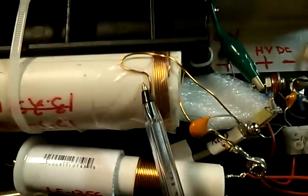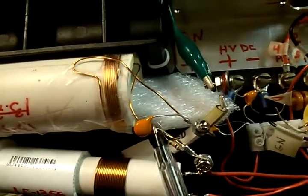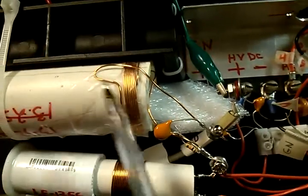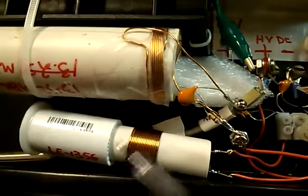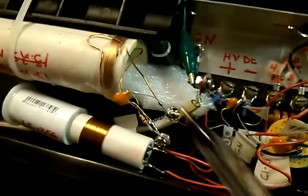This is the original one here. We've got 2 in here. This is the non-adjustable. It's going to be replaced. We've got a 12 picofarad capacitor here, and we tune it by just having the right amount of turns on here. This was a 1.5 inch PVC, 8 turns on here versus 17 for a 1/2 inch. So you want to use a smaller one because you can get more turns, so you can fine tune that. It was really hard to do a full turn on this big of a pipe, so that's going to be replaced. Load cell, let's see if you can see that here.